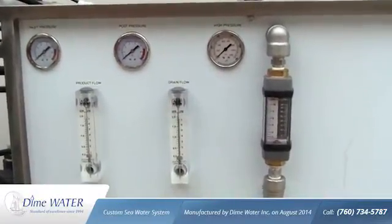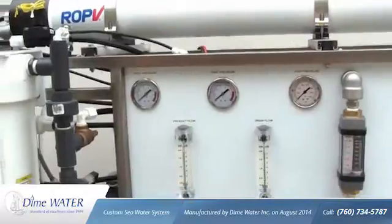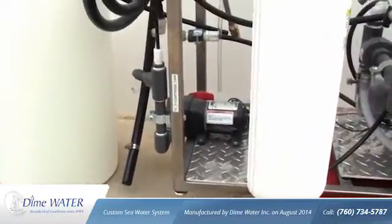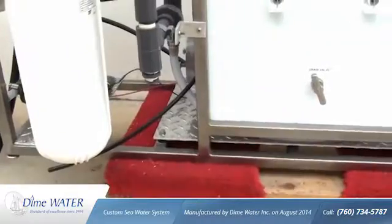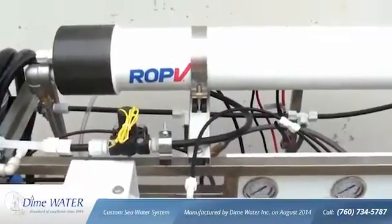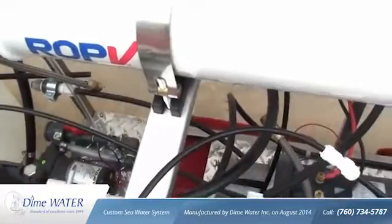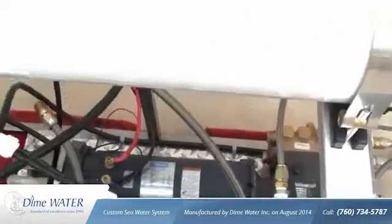To feed the unit, not knowing for sure what the source water will have as far as pressure is concerned, there is a small pump down here. It's a positive displacement pump that will draw water either from a surface supply of seawater or from a tank to provide water to the high-pressure pump and then to the membrane. It's articulately designed to be simple in nature and just run virtually forever without any attention.